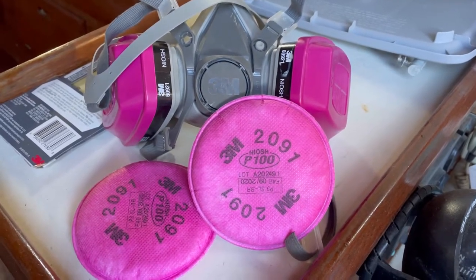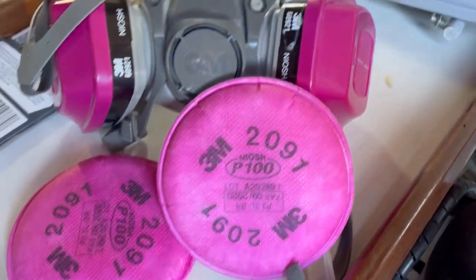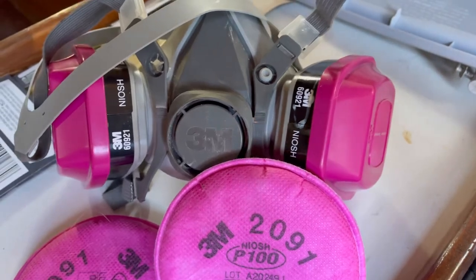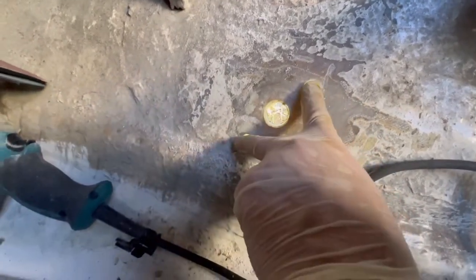Make sure you have a respirator for sanding, as well as for the epoxy work, some sort of vapor cartridge. Here the hose we're gonna plug up. They're the old bolts. Now we're using a backer plate and a flange seacock. So we're only gonna need the 3/4 through hole. We're not gonna need these bolt through, so we wanna seal those up.